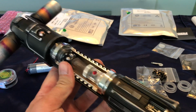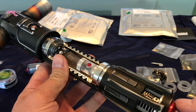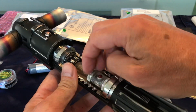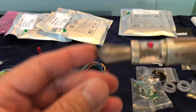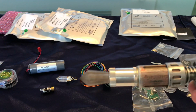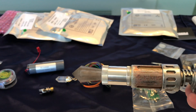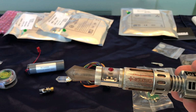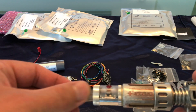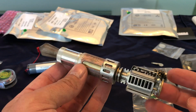But if you're curious about what I did to this crystal before, I basically sanded it with some 80 grit sandpaper around the edge of it, and then I used a lighter. Here you can see a little bit better. It looks a lot better than the weird plastic ring it was, but it's still not a real crystal. So I scratched it up with some 80 grit, tried to keep the lines all lined up together. And then I used a lighter, maybe this far away, and it kind of blackens it up, and I wipe that off. So this is pretty much stable color-wise. This is how it looks now. But yeah, I just thought that looked a little bit cooler for what this is before I cut this up.